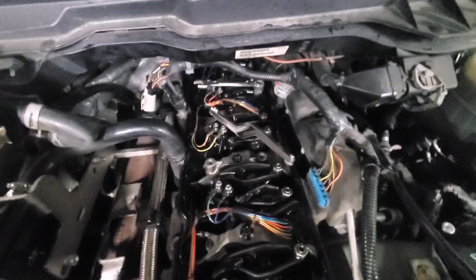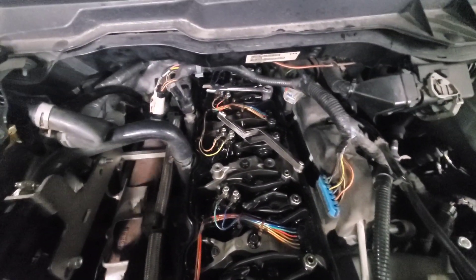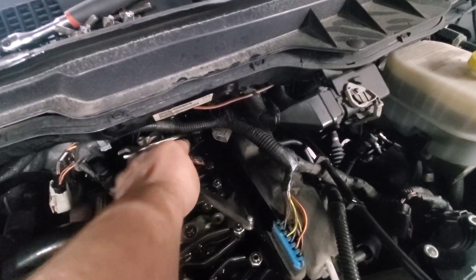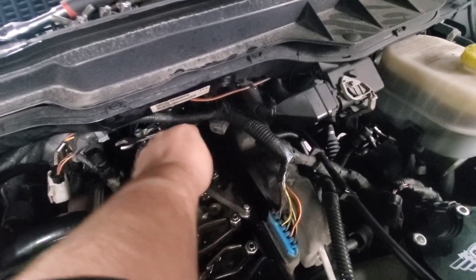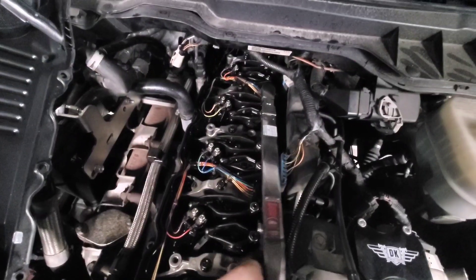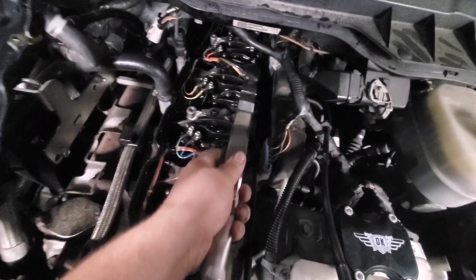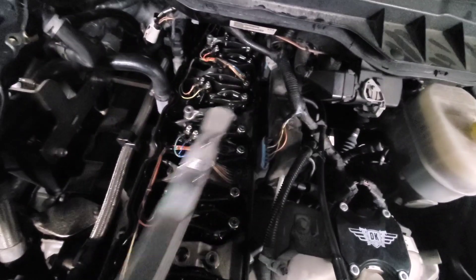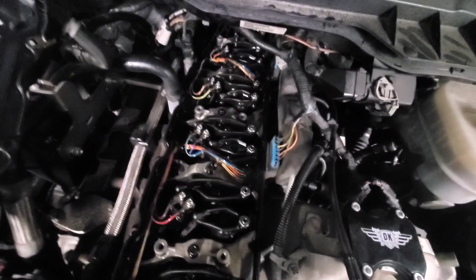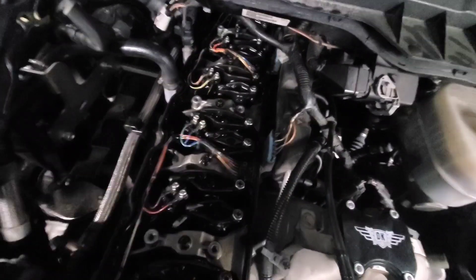I made that so it will sit just like that — we have clearance off the rockers and everything. My Allen wrench will grab down the center of it still, so we're good to go. Now that we've got the adjustments done on this first position, we'll take the torque wrench and make sure all these nuts are tight. They go to 212 inch-pounds. After we get them all torqued, we're going to run back through one more time with feeler gauges and recheck all of them to make sure tightening didn't change our measurement.